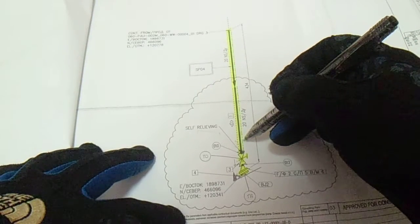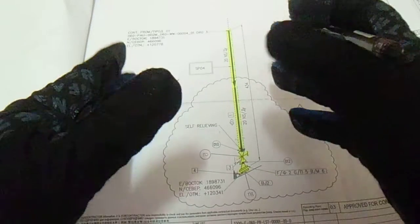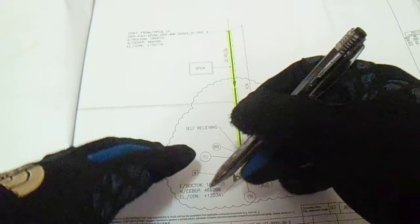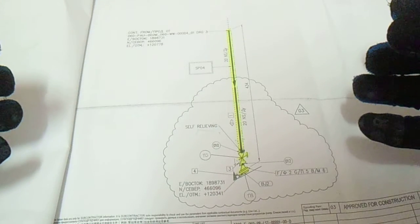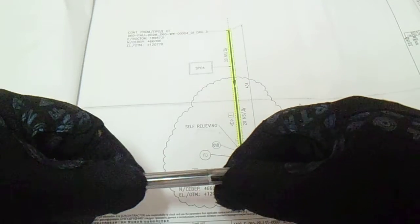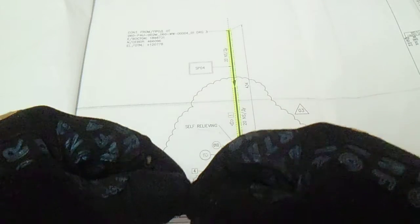Okay, so note again, we have attachment from the pipe, so all attachment from the pipe is all category A, and all guide supports, and like this, and also this hand wheel is only category B. So easy, this is not an attachment from the pipe, this is all category B. So all attachment from the pipe is category A. Okay, so this is how to line check.